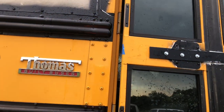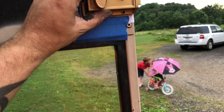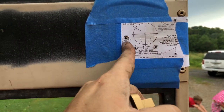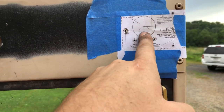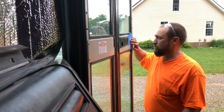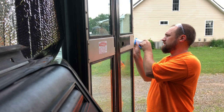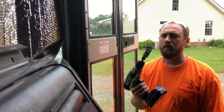Now I'm working on using the template for the door lock placement and drilling out the holes for the door lock. I'm going to pre-drill 1/8-inch holes at the marked points, and pre-drill a center 1/8-inch hole for what will become a one-and-a-quarter inch hole. I've pre-drilled all my holes, so I'll take the template off and now drill my one-and-a-quarter inch hole through the door.